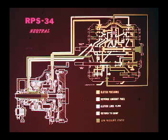In this illustration, the selector spool is positioned for low drive, and the C1 and C2 pilots would normally be actuated. The reverse lockout spool position causes the C1 pilot circuit to be shut off and opens the C2 pilot circuit to reservoir. The reverse lockout spool position also permits pressurized oil from the right-hand end of the selector spool to pass to and actuate the C4 pilot. The actuated pilot permits pressurized oil from the supply gallery to pass into the C4 clutch, and no flow of power is possible through the power shift transmission with only one clutch engaged.